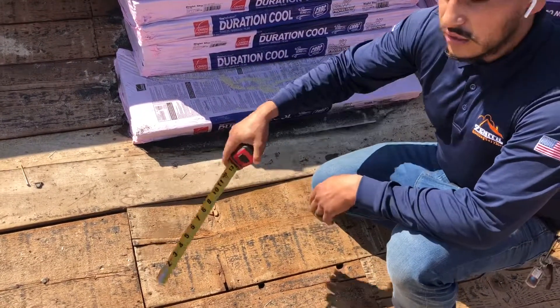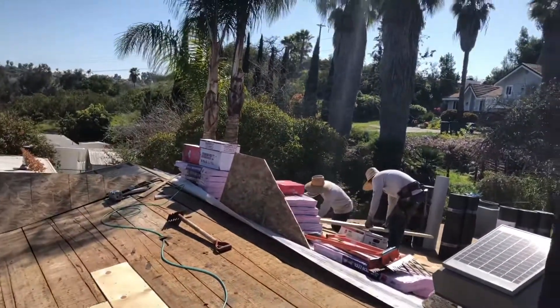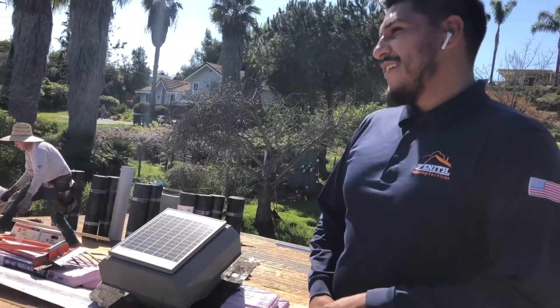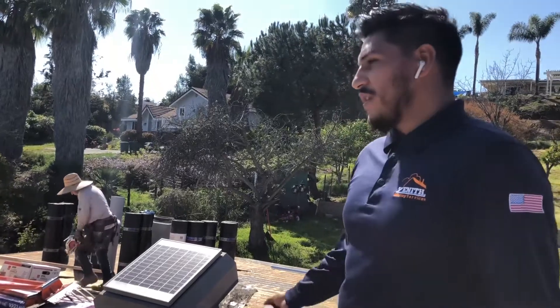It's always the best way to go. Once you have plywood, you stagger your seams and nail on the rafter. Question: how old are roofs that have planks? Usually they were built in the '60s. Very common in other areas — out here in California, San Diego County, you don't really see that many unless it's an old neighborhood.